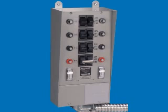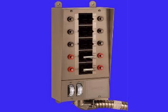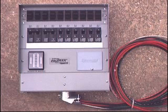Generally, the transfer switch models that have push-button circuit protectors can only be used on branch circuits fed by 15-amp or 20-amp breakers. However, some newer models that have molded case toggle-type circuit protectors can be used on branch circuits up to 30 amps. This is large enough to power some big appliances like electric water heaters.